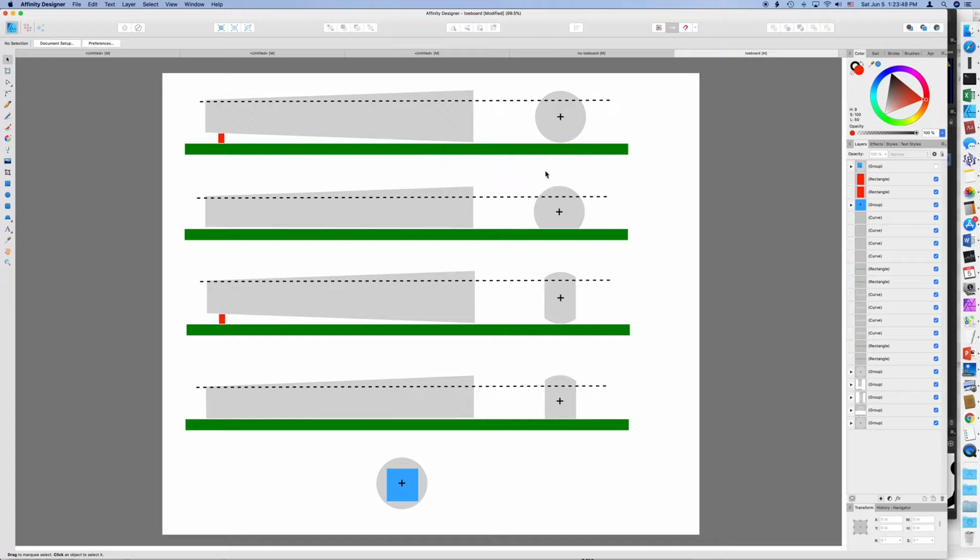Then we're going to roll that log 180 degrees to make our second cut. We do not use the toe board on this second cut because the surface that we've got down on the mill bed now, that's the one we made up here in the first cut. That's already parallel to the grain. It's parallel to the center of the log. So we do not need to use a toe board here. So we'll go ahead and make our second cut.